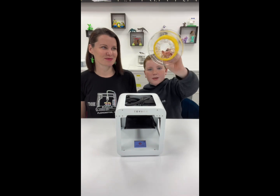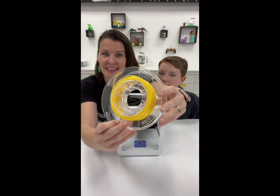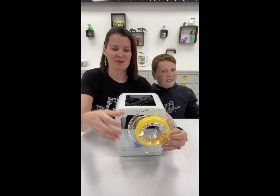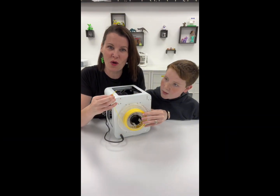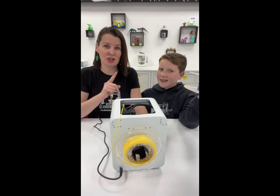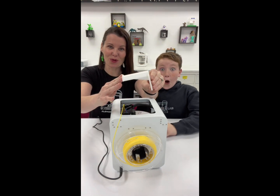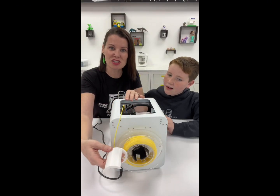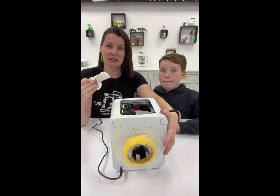Now that we're connected, let's get our printer food ready. We're going to use yellow so you guys can see it. We like to have a nice clean cut end sticking through this tiny hole of our spool so we're ready — you can use scissors, or you can use snippers. We like the snippers better. We're going to put this on the back of our printer by snapping it into place, pull out of the hole, and put that end into the tiny hole on the extruder box. If you have a bigger off-brand spool, you can actually print a larger spool holder from the Toy Box app. It'll come with three little printed screws — you'll attach that here and you'll be able to get a larger spool on. It also makes getting these on and off a lot easier; you don't have to snap anything into place.